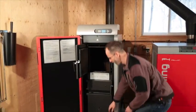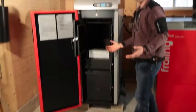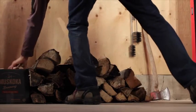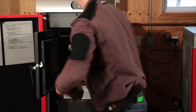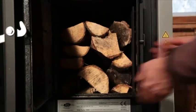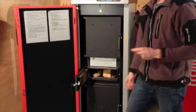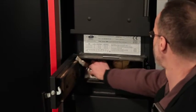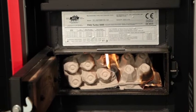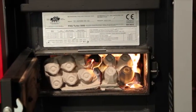This is the ignition chamber door, and behind this door is the access to the gasification chamber. To light the boiler, we just put firewood in it. I'm going to start with some kindling and then firewood cut to 20 inches. Load it right to the top, then close the fuel loading chamber door. Here we've got our ignition chamber — I'm just going to use a couple of old egg cartons. Use whatever you'd like: cardboard, some newspaper. Once the fire builds up a little, we'll turn on the draft fan, and you'll see the boiler suck that flame right in.